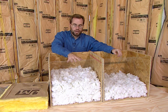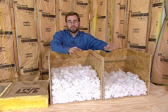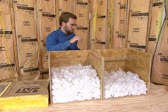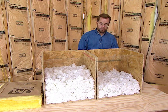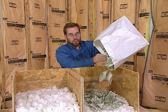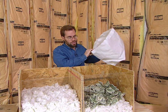I highly recommend you upgrade to an R38. R38 will work anywhere in the country and keep those utility bills low. If you don't have much insulation in your attic, you can add some — go to a hardware store, and if you buy the insulation, they'll even give you a blower to use. It's not hard to add. If you don't want to go in the attic and fill it up with insulation, you're going to be filling it up with money every month. Go ahead and get R38 in the attic, and while you're building those walls, go to a 2x6 and use an R19.